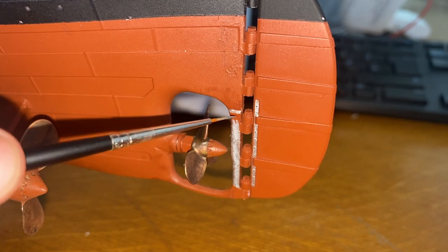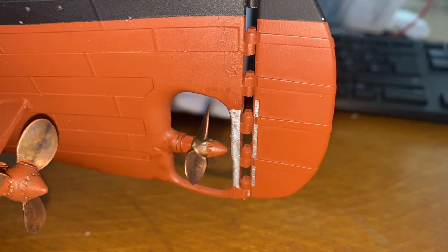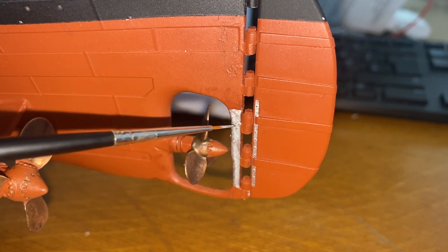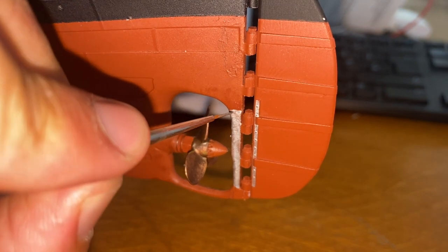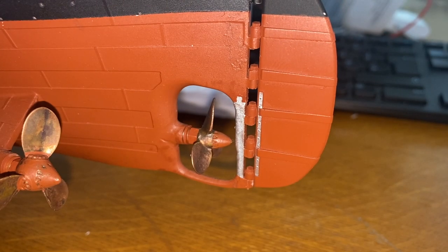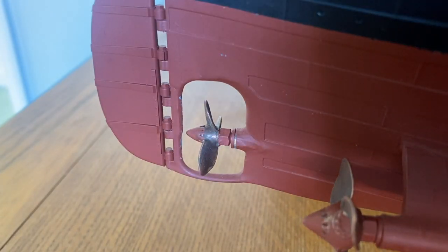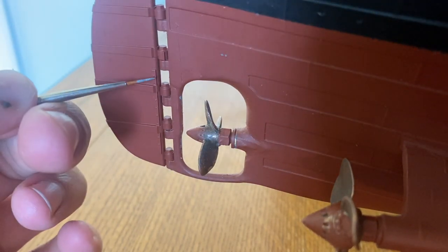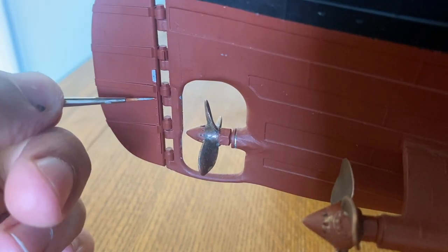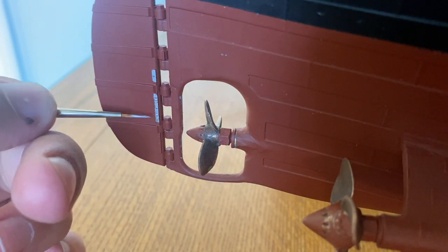And in the case of the Titanic, you have exactly this, because you have the ship's ironwork, the hull, and the rudder are both made from iron. But then the ship's propellers are made from bronze, and they are separated from each other by salty water, which can act as an electrolyte. So what will happen is, you'll actually get a current flow across this. And in the case of the Titanic, the ironwork will quite literally give up some of its electrons, which will flow through the salt water to the bronze propellers. And that's really, really catastrophic, because what happens when iron loses its electrons is it corrodes, and it can corrode incredibly fast. And obviously that's the exact opposite of what you want.